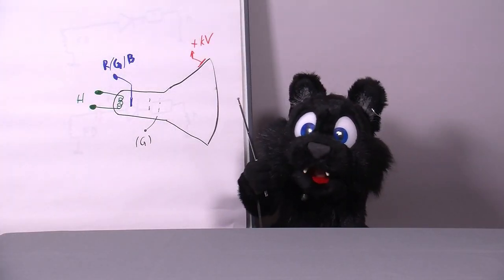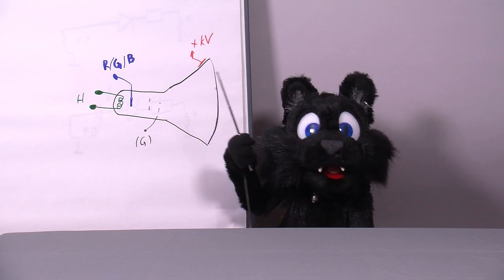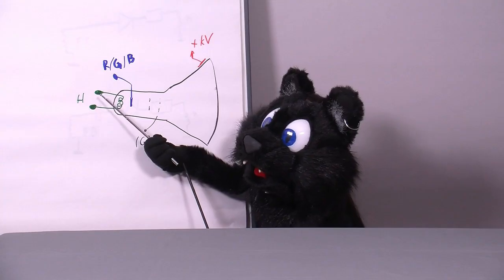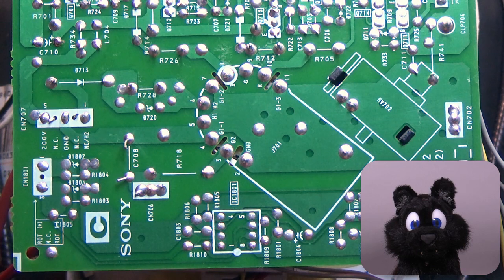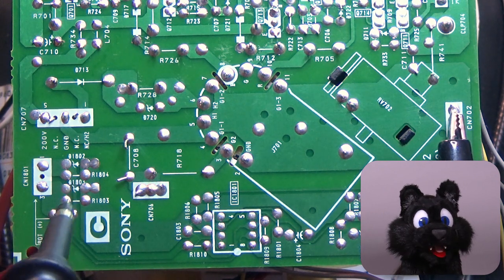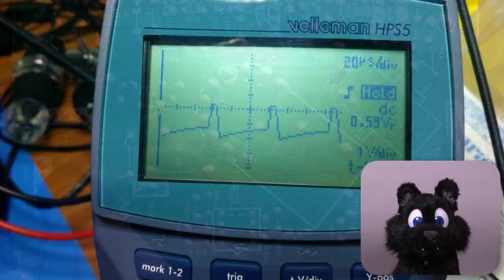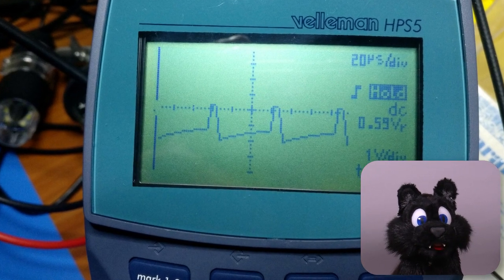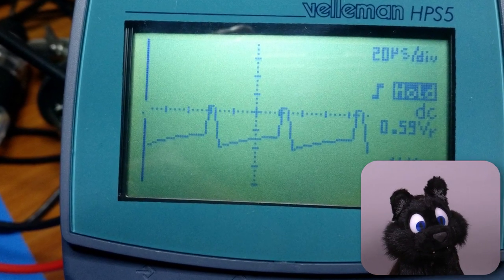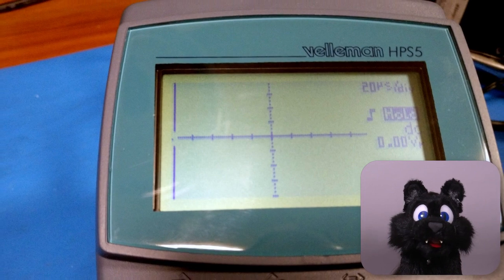To find out what's wrong I started with the basics — voltages on the CRT. The high voltage works, but there are at least two others involved to make something light up: the electron gun ones and the heater voltage. I used an old portable scope to protect my regular one, and my very first checkpoint was already promising. The heater voltage was showing a rather strange value — a pulsed AC which might be normal, but mostly negative and only up to around two volts peak to peak. After the rectifier diode on the neck board, as expected for a negative waveform, it dropped to basically nothing.